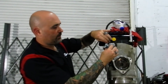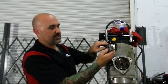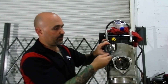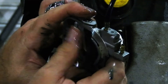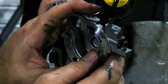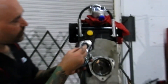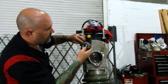To test your pump, go ahead and rotate that little gear. Wacker says if you're putting on a new pump, it should take anywhere from 20 to 30 rotations before you start seeing oil come out of the output nipple. Once you see the oil coming out, you know the oil pump is primed. You can go ahead and stick your new gasket on.